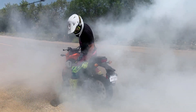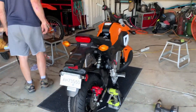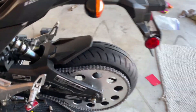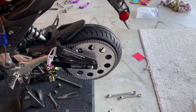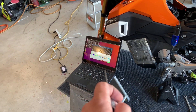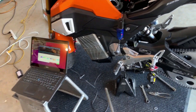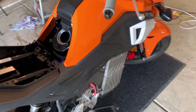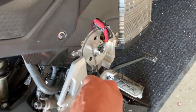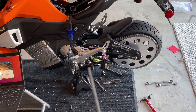I still want some tires — I need to make it home. Two hours later. All right, so we're back from testing. We stopped at Shapiro Motorsport and got a bigger tire, so we get a little more clearance on the left-hand turns. We're still working on that — might get a different rear sprocket, but for now it's good. All the stuff in multi-tool looks really good; that's the tool that tells us everything about basically the drivetrain system — temperatures, et cetera. Right now we're just buttoning up hardware stuff, getting a cover put on it, making sure no hardware is missing. We swapped out the chain to an O-ring chain and we're working on the chain roller to see if we can get it a little bit quieter.